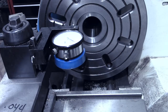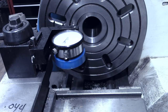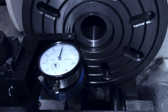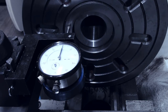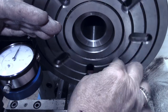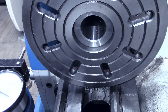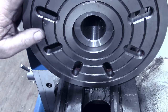I'll bring the indicator in on the innermost ring and lock the carriage down. That's dead on zero there, and there's about a half a thousandth on the inner part of the ring. If I bring it out toward the outside it looks like maybe one thousandth runout on the very outside. Honestly I don't think I can do anything to make that any better, but I do think we can get some of this out on the outside rim.